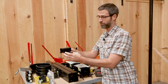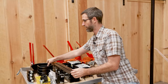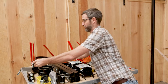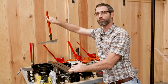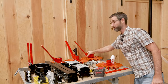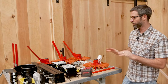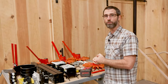These are our cross clamps, and they allow us to make a T with our two inch tubes. These are our flex mounts — they're like an S-tine but allow us to put a finger weeder or an A-blade in and slide that shank vertically through. Over here we have our A-blades. We have sizes from four to ten inches that give us a really nice shallow but good cultivation. And then over here we've got our finger weeders. Today we're doing a setup for two rows at thirty inch, so we have four finger weeders.